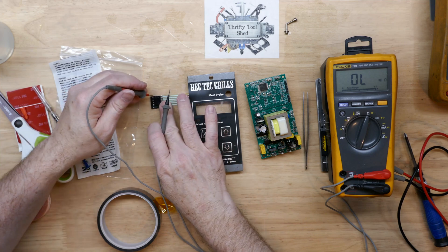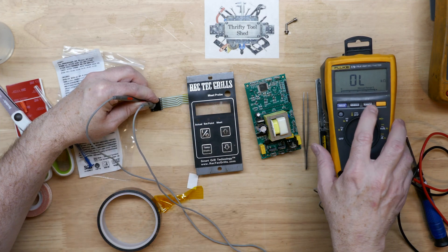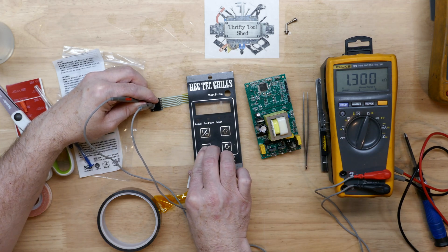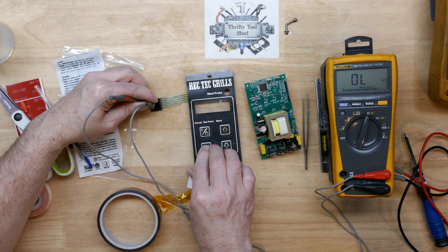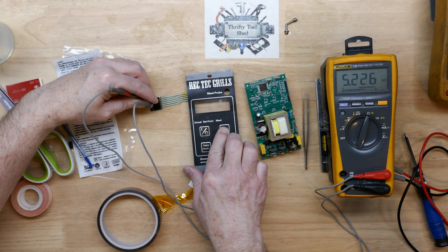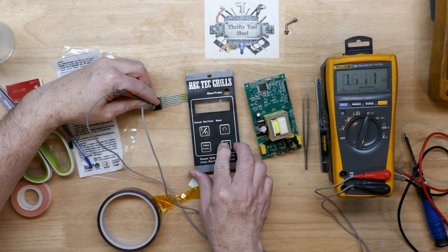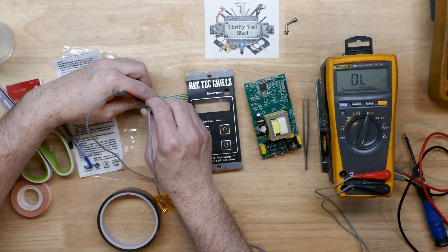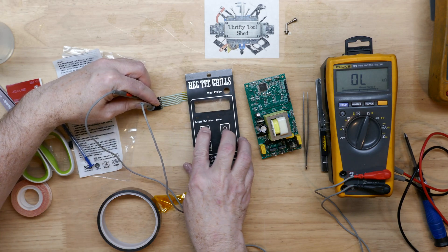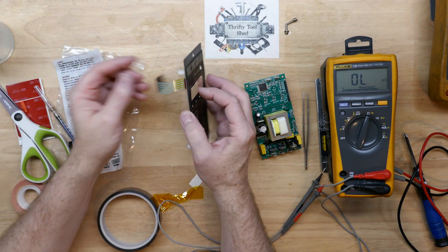Let's check it out. That second one from the top doesn't go anywhere the way these traces are. We're definitely picking up down below the kilohms, so that should be good. That's your up, that should be good — down, yep. Anytime you see it go below 1k it should be fine on these. The microcontroller is just picking it up — I think these buttons are just pulled low with a pull-down resistor, so it doesn't take much for it to pick up as an input.